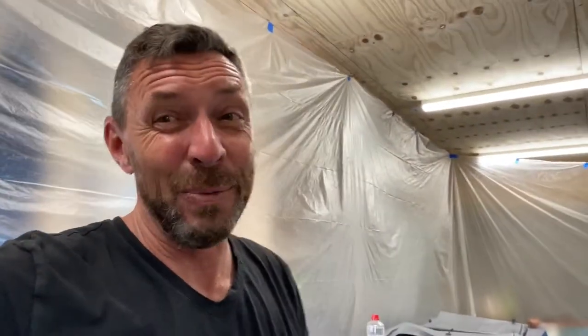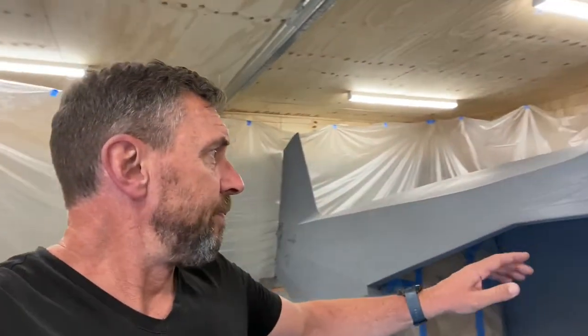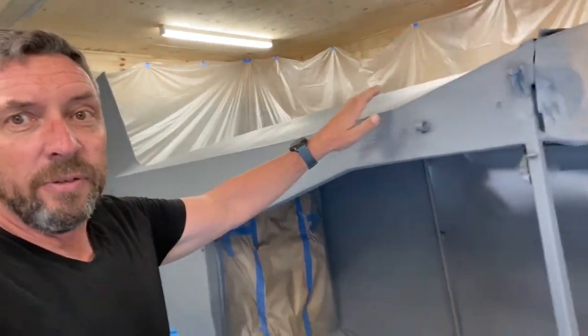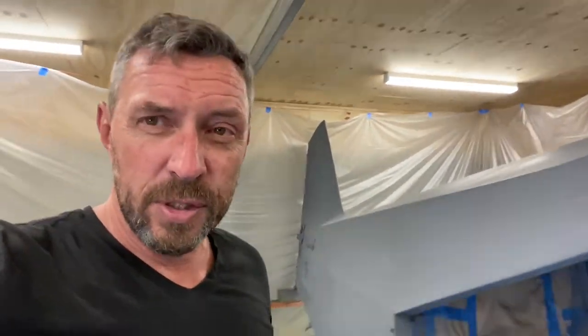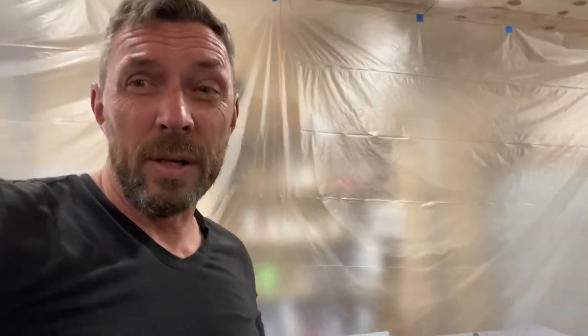I'm about to call it quits for the day. It's really, really hot here — we've got a nor'wester, which is a foehn wind in New Zealand. A foehn wind you only get in a few parts of the world, and it gets very dry and really hot. I'm in a shed that's lined and insulated, and it's over 30 degrees Celsius in the shed — and if you're trying to convert that into Fahrenheit, it's bloody hot. So I've rubbed back the fabric with 320 grit sandpaper and then used a red Scotch-Brite as per the instructions, which brings it up really smooth with a good finish. I've still got to do the belly, the gear legs, and the doors — that can wait till tomorrow morning.